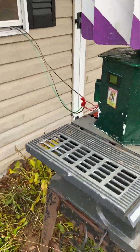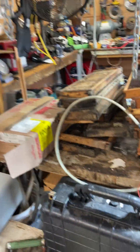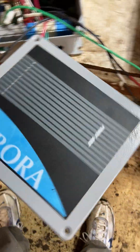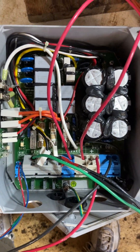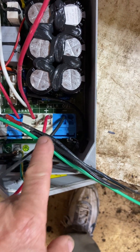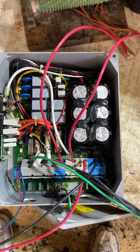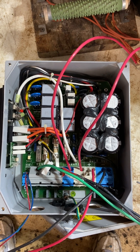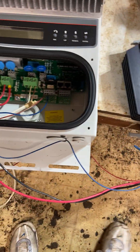Here you have your turbine's three-phase AC coming out of it — this is the big part for the consumer. When you purchase a turbine, where are you going to send that power? This is going to go three-phase AC into — shout out to Power One, they bought up Aurora — this is their wind interface box. You take your three-phase AC, do all the magic engineers do, and bring it out as bulk DC for your inverter. This box is gold — it's the last one on the internet I could find. Without it I'd have a $1,000 block sitting outside that would never work. This interface box is essential.